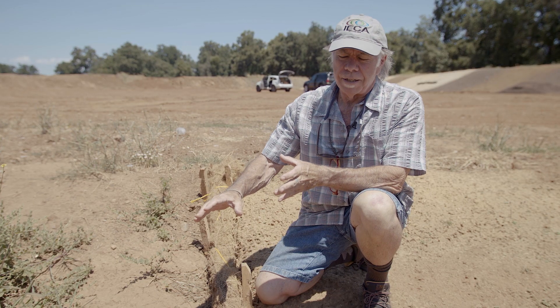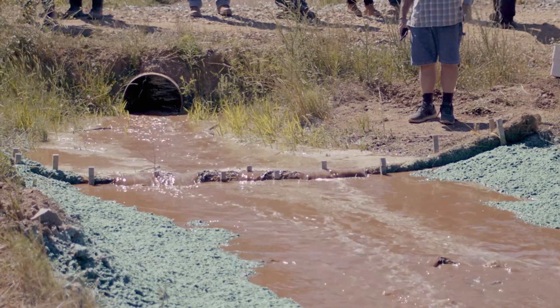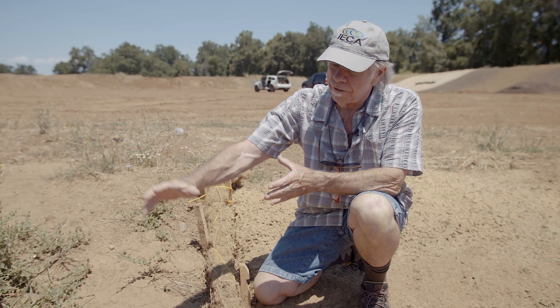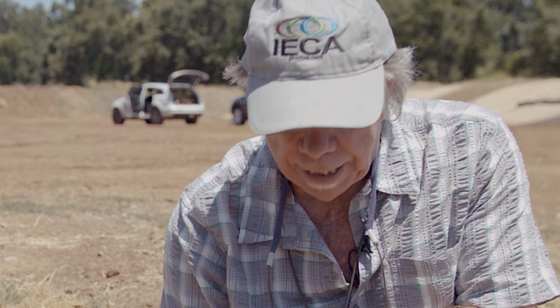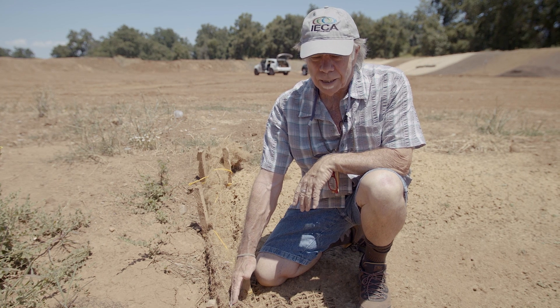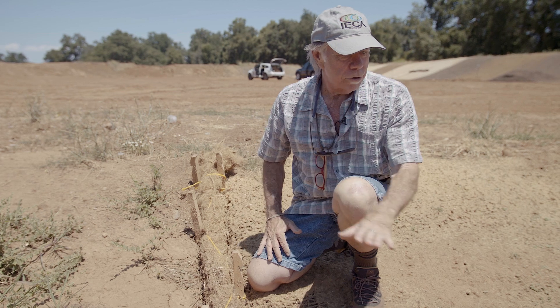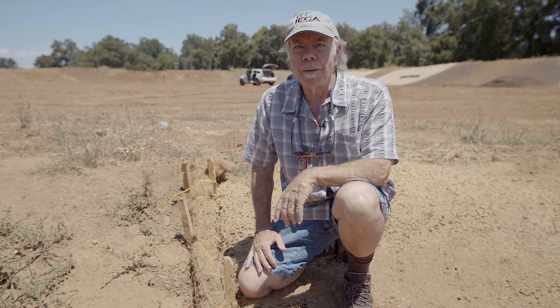This is a high-energy feature. There was a culvert coming out — water came out of the culvert, went across the scour stop transition mat with a lot of energy. That energy is looking to go under and scour underneath our netting, and we don't want that to happen. So that's where we use the Bio-D block to break that energy up, bring the water back to the surface so it flows over the top of the netting. And that's what happened. We're very happy with that.